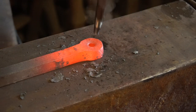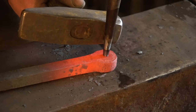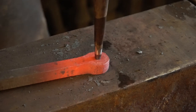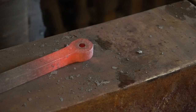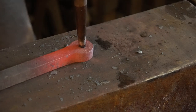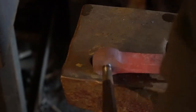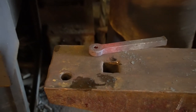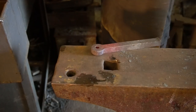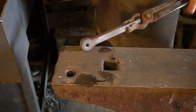I'm starting to get some resistance now so it's time to turn over. I'm going to use that hole that I've done as a lever to turn the bar over, and use my hammer as a guide again to give me a bit more control and placement on the punch. I'm going to keep cooling the punch down — the last thing you want is for it to get stuck. My piece is now touching the bottom of the anvil so I can go over to the pritchel. One good bang and I've lost the slug. I'm going to punch out and cool it down. My punch hole now goes through both sides nicely, in the centre — ready for drifting.